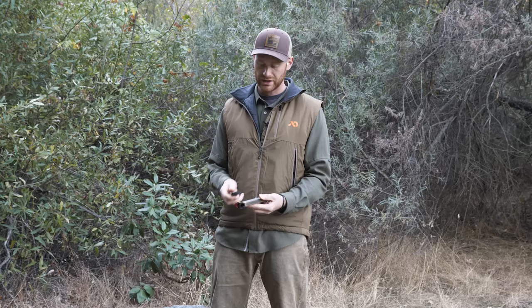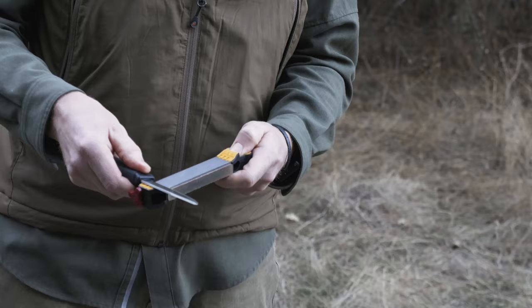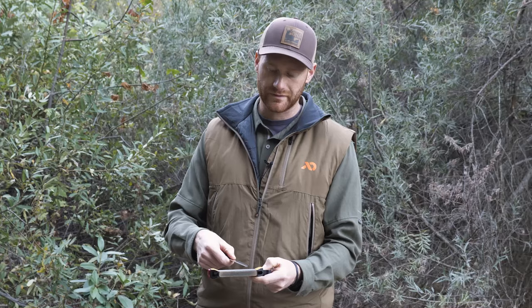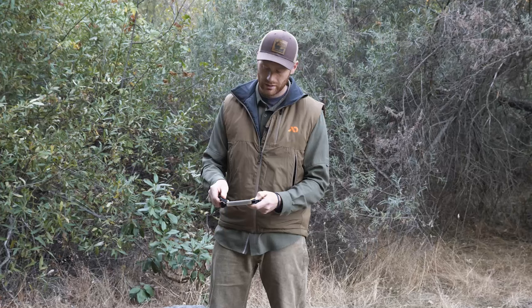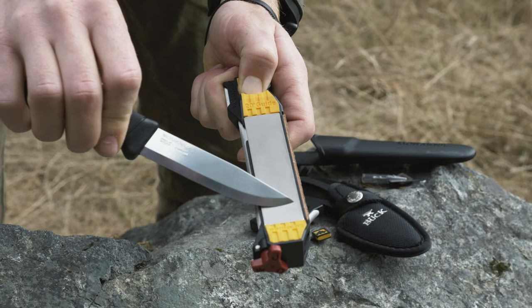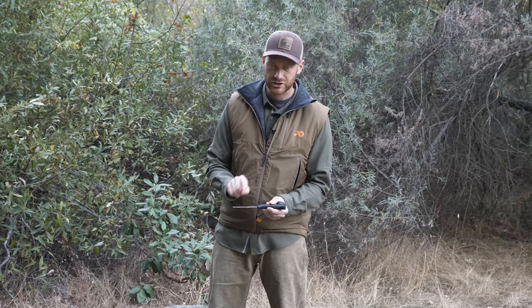You could even rest it down on a table, a rock, or some sort of work surface. I'll rest the knife on the 20 degree guide and make a pass along the diamond. Notice I stop with the tip of the knife in the middle of the plate, without dropping it off the edge — if I run the knife over the edge of the plate I risk damaging the tip by shaving off some metal. I'll make about three to five passes per side until I begin to raise a burr. I check for a burr by pushing my finger away from the edge on the side I just sharpened — it should catch like a fine wire on the very edge.